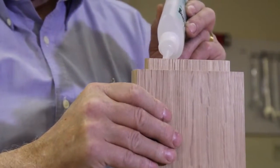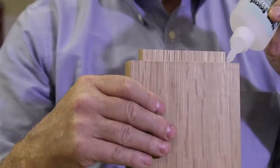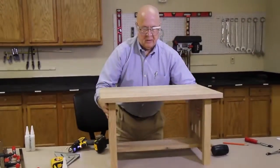Because Nexabond 2500 is not a water-based adhesive, it works well on oily substrates — it works well on teak, cocobolo, and other oily woods. It contains no water and no solvents, which means there's no waiting for the water to leave the bond line before you can go to your planing and sanding operations.